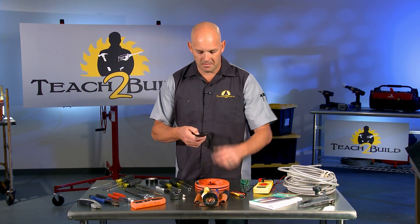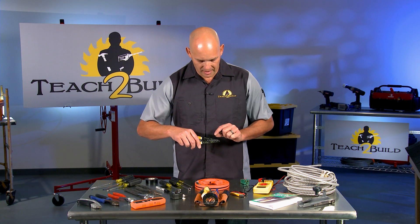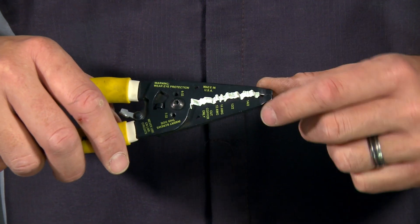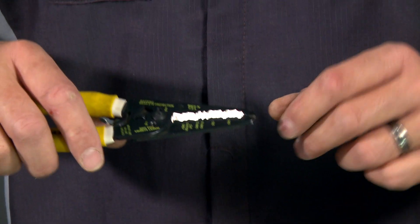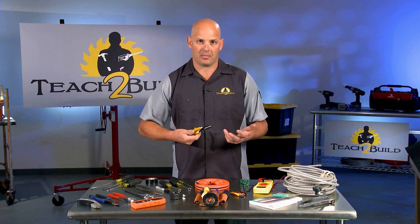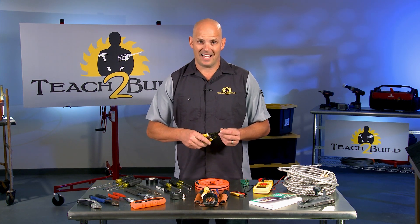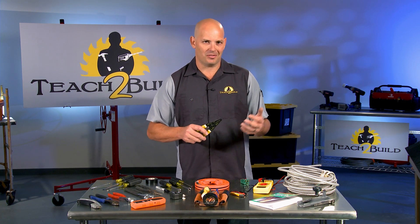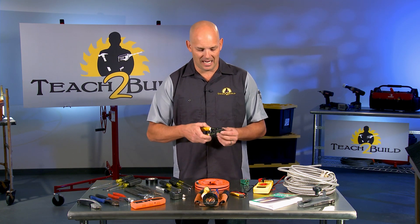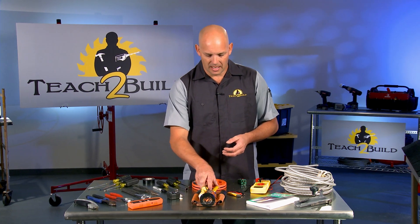These are the wire cutters I use most of the time. They not only cut but can strip individual wires — 14 gauge or 12 gauge. They also separate the outer insulation off Romex in 14-2 or 12-2 so you can get that outer layer off easily. The very end is great for grabbing the copper wire and giving it the right twist to wrap around screws on a switch or outlet so they're pre-shaped and ready to go. I recently saw a version with a slight angle at the end for stripping insulation inside a box.